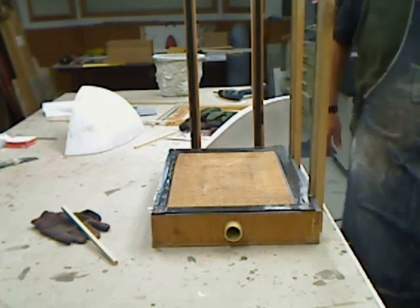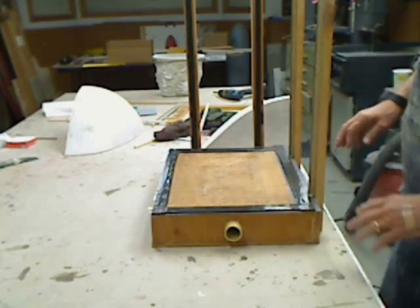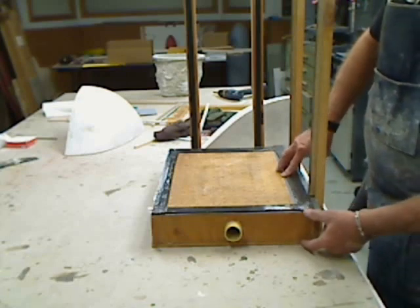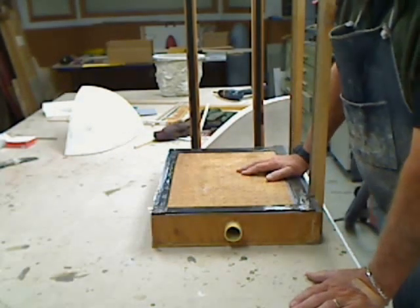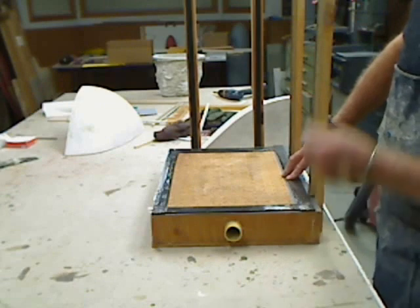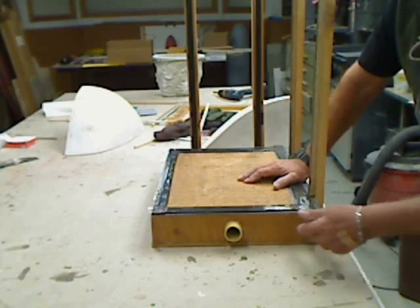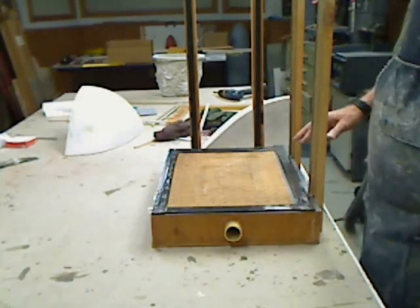The next step is the vacuum-form canopy, so you need a vacuum box. It's a very simple construction — a box with a quarter-inch or half-inch ply bottom, about three-inch height sides of plywood, and then it's covered in one-eighth-inch pegboard so we've got the holes in here. This little fitting down here is just cut from a vacuum hose and siliconed in so that you've got a place to put your vacuum hose in. When you assemble and screw it together, run silicone caulk sealer through all the joints so that you get a good airtight seal when it all cures up.